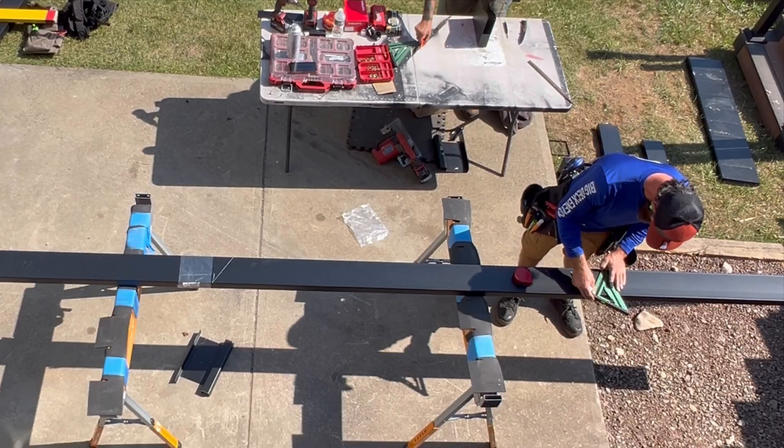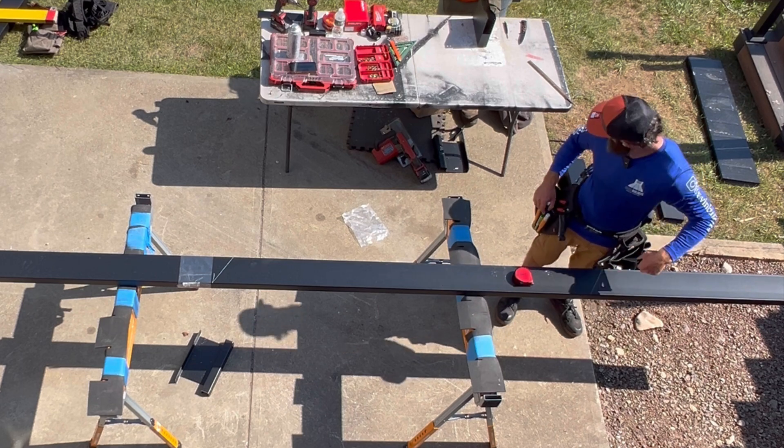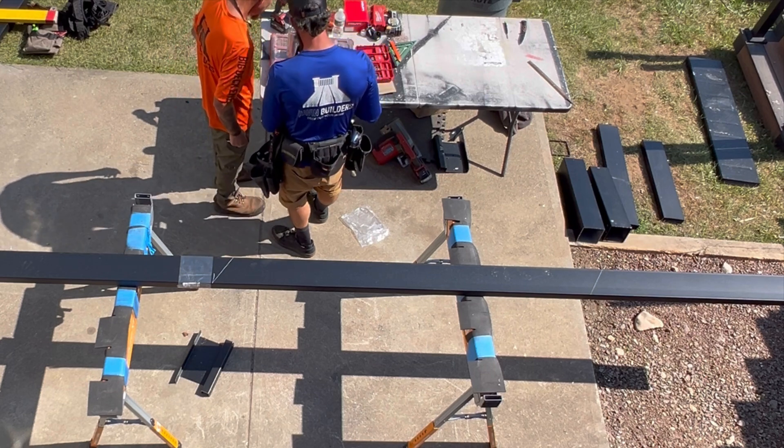We leave the bottom long, just leaving myself some room there. I'm going to make three plumb cuts for three pieces of joists that are going to be plenty long to complete the stringer, and the bottom will get cut off later.